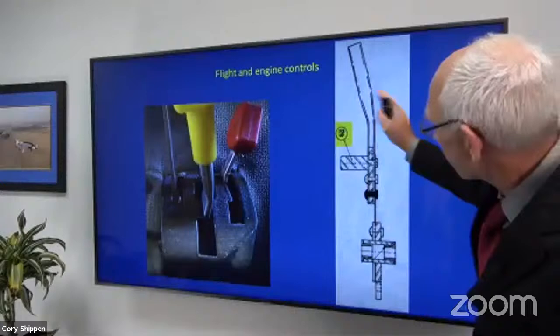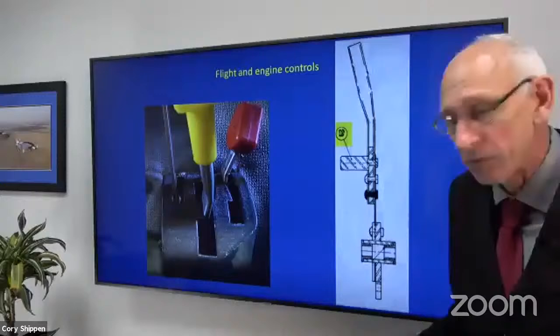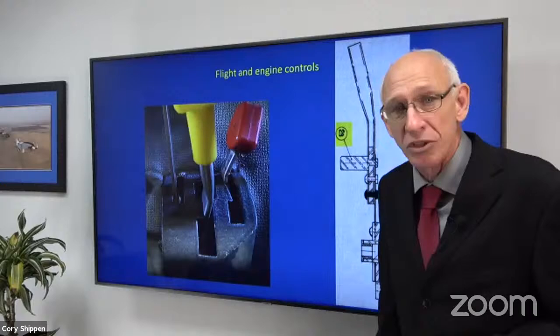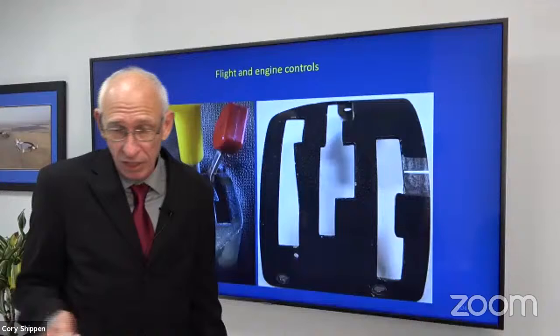And there's that pin that should hit the rotor brake when it's applied, and you can get the aircraft, I think, to 20-30% NG. The engine will start to spool, but it will not start. That is to say, unless, usually in my experience, it's a pilot-mechanic relationship, and the pilot says, hey, the rotor brake doesn't stay on, can you do something about it?